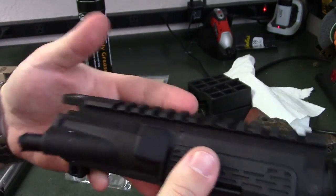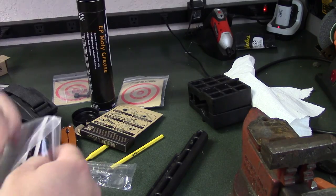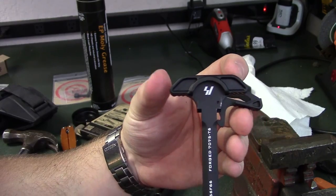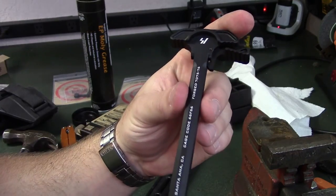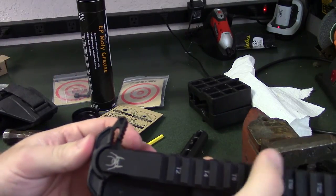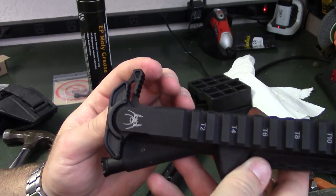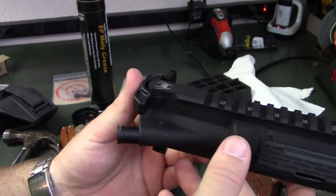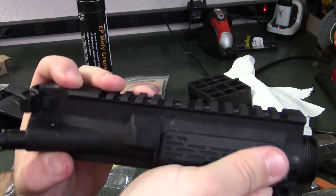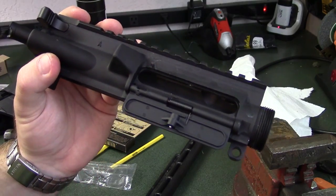Pretty simple and straightforward. At this point, my upper is pretty much assembled. The only addition left is going to be the bolt and the charging handle. The charging handle is also from Strike Industries. I'm a big fan of extended charging handles with a bigger latch. I've primarily used the BCM one in the past, but this one — I don't know what coating they put on it — it definitely slides a lot easier straight out of the bag. Normally it's really gritty and tears a lot of the finish off before it starts cycling smooth, but that was not the case with this one. The upper receiver itself is now pretty much assembled. We'll put the bolt carrier group in at the end, and we're now ready to put on the barrel, gas assembly, and handguard, which will be in the next video.